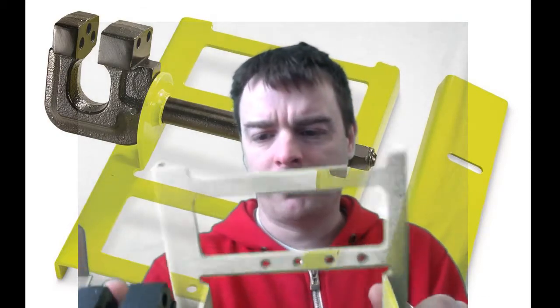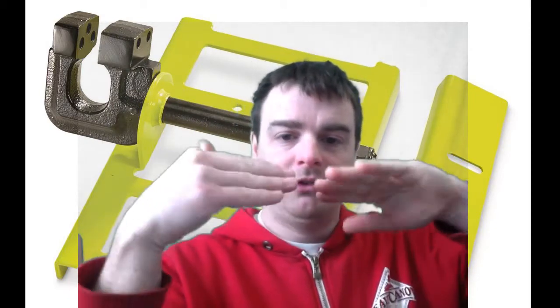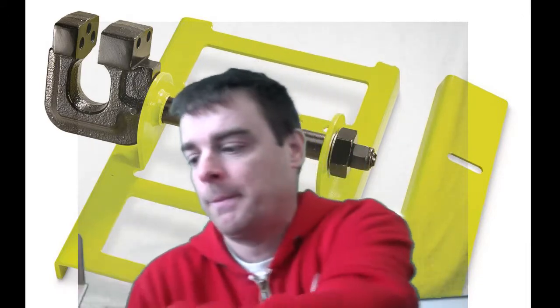It's powder coated green — which is why it's being keyed out by my green screen. It's super basic, but it allows you to get right-angle corners to start your cut. You don't necessarily need two-by-fours on both ends; you just put a straight two-by-four on top, screw it down, look down the end to make sure it's straight and not twisted. A two-by-six would be even better for added stiffness as you move along with the chainsaw guide.